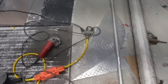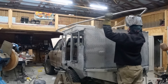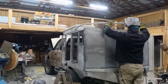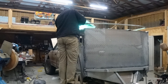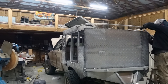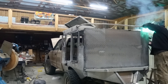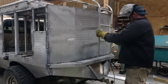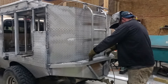Here's my tubing. I put it in my tubing bender. After I took my measurements, I got it to match the top of the truck just right. This is three-quarter-inch tubing, and I will mount it just to the edge of the tool box. I've got some flat pieces to hold it up at different points all the way around the top. This will be good to keep things from rolling off — like maybe you smash a big buck and you can put him up there without worrying about him rolling off. We'll also have a cooler rack on the passenger side closest to the cab, also three-quarter-inch tubing. Once we get that up there, we've got to put a ladder — three-quarter-inch tubing again — and it will weld to the bumper and right up to those flat pieces that hold that rail in place.